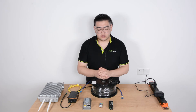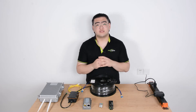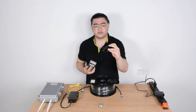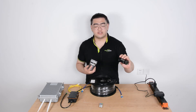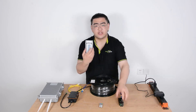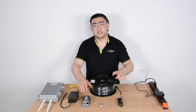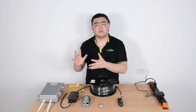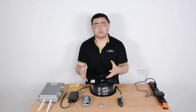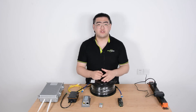To set up a fiber optic link, we usually need five things. One: a fiber optic cable, which is a special kind of cable with several types — we have to make sure we get the correct type. Then we need two media converters. This traditional media converter has indicators, an SFP module port, an ethernet port, and power. This outdoor waterproof media converter has the same features but is designed to be set up directly outdoors, rated IP67 waterproof, meaning it can be exposed to rain without damaging the internal components. It also has waterproof glands to tighten around the cables when connected, to prevent water from leaking in.